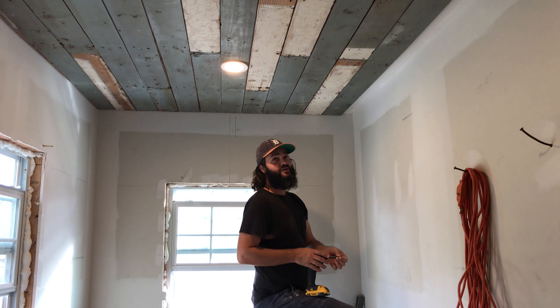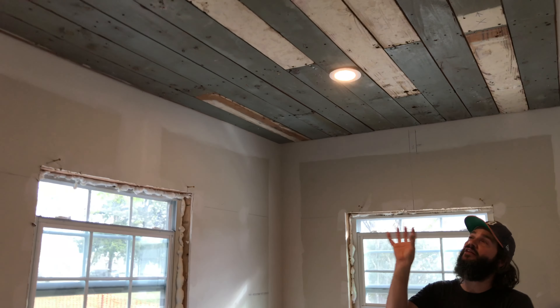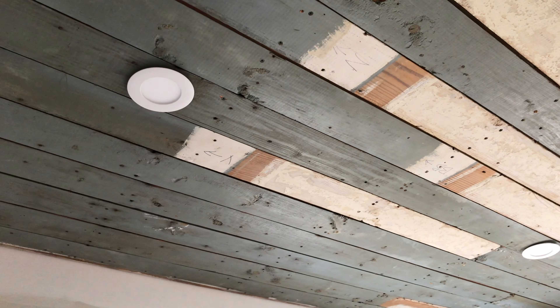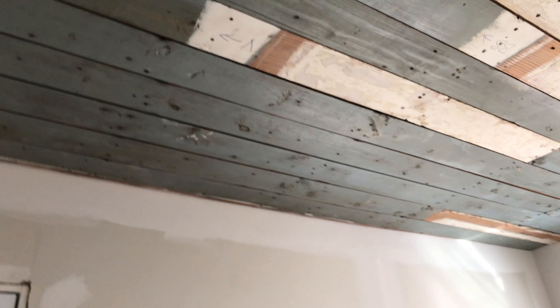So now we've got to decide what to do for the paint color. Part of me kind of likes it the way it is, but I think it'll be better white. Look at the vent — yeah, I think we need to do it white. The only thing I have to do now is finish this last piece and then the light fixtures — the hole is the right size but the light itself has some ridges on it, so it's about a quarter inch from touching the wood. I've got to go through and just cut away a little bit, and then that'll be done. It looks so good. I like these lights out here because they're flush with the ceiling, and since the ceiling is like eight feet — maybe a little bit less — if you're carrying stuff through here you don't want to bump into the lights. So these ones I like because they're recessed. I don't want recessed lights in any other parts of the house except for maybe closets or maybe the bathroom.